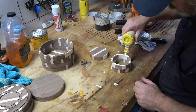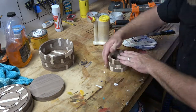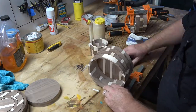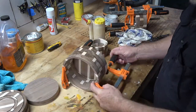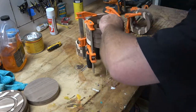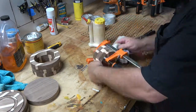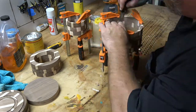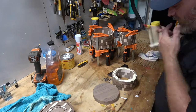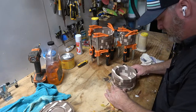Along the way I'm cleaning up as much glue as I can to make sure I don't have a bunch of glue marks on the inside. I've got a nice wet rag for my glue cleanup. Now I am using Titebond 3 — no glue like this is truly waterproof, but because this was going to get washed, I need to make sure I have the stickiest and tackiest glue I can, so I like Titebond 3 for this application. I'll use some F clamps, clamp everything up real nice and tight. Now I've got the bottom for the third bowl on so they all nest together.